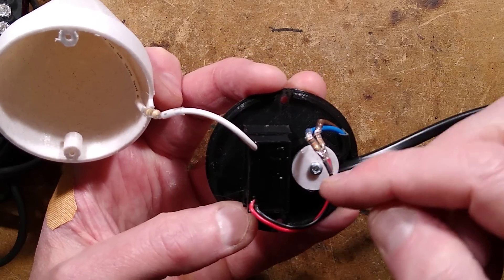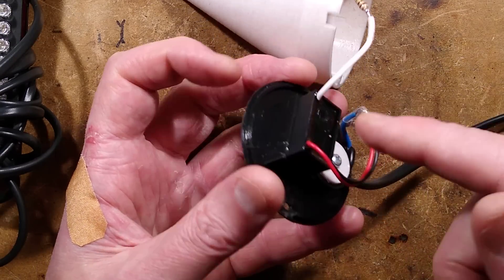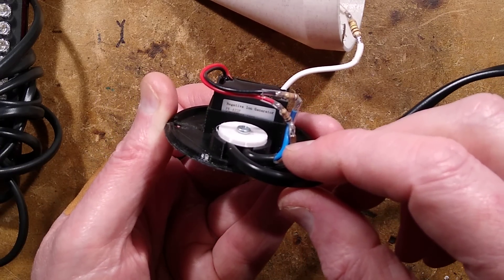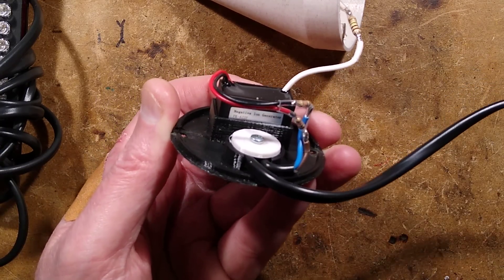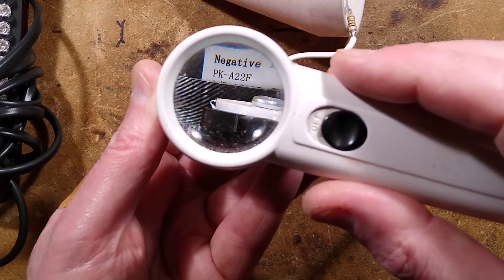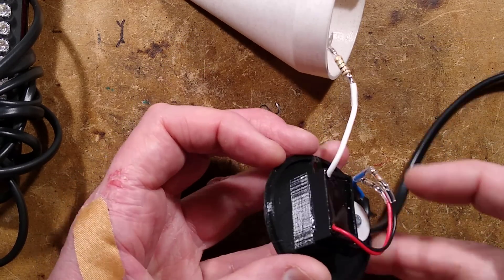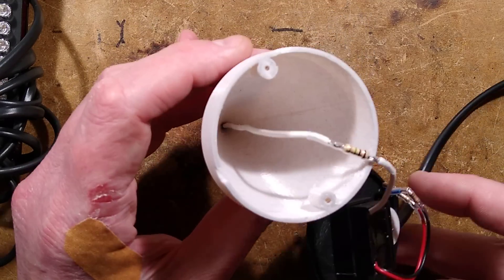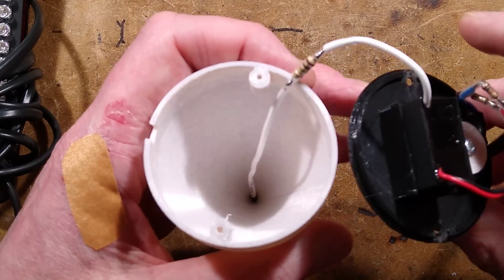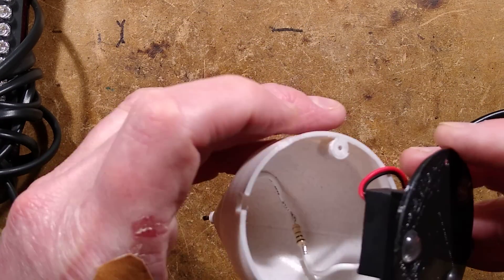I've got a couple of resistors in series with the little ionizer module - it's a PK A22F - although they do tend to stick that number on many things. For the output I wanted to use a bigger one-megaohm resistor, and I used this one-megaohm resistor with sleeving. It's designed so that now it's all put together I can stuff that up there out of the way.